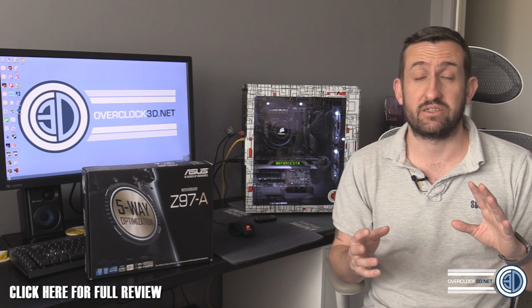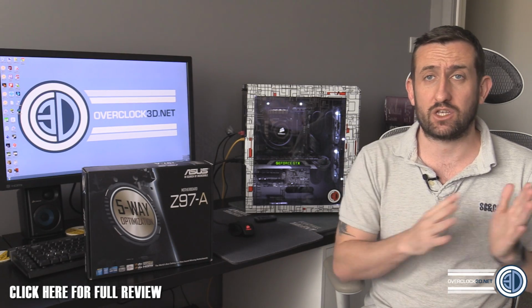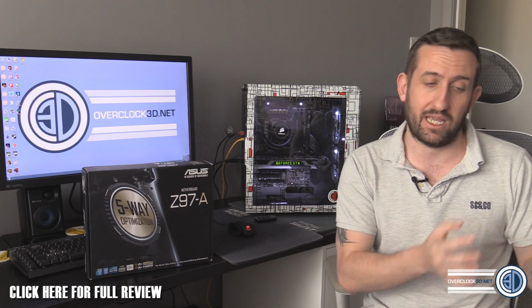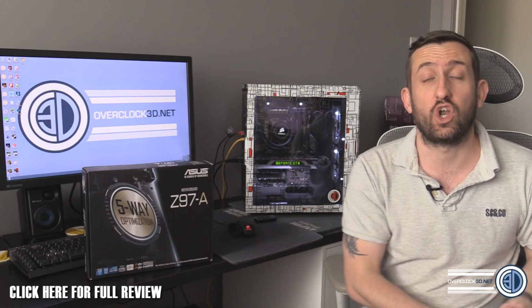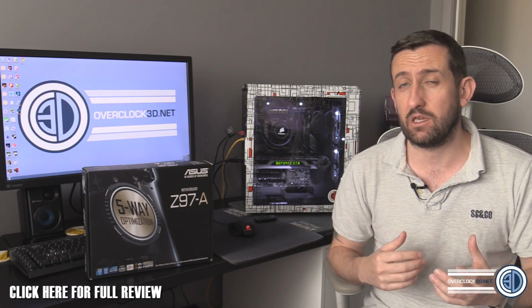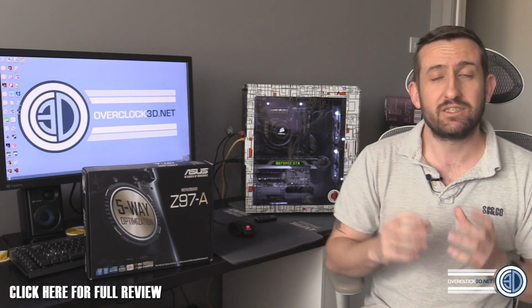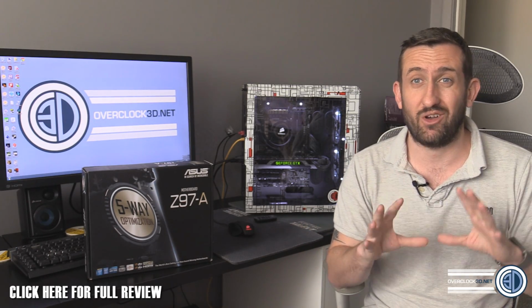Hopefully, and this is the theory behind it, we're not 100% sure, because until we start testing we don't know, it could open up the variables between different boards again. It could mean that a cheaper board will not overclock as well as some of the more expensive boards. But therein lies a bit of a conundrum, because the CPUs, like Ivy Bridge and Haswell, are so very efficient, we still don't know whether they actually need all these power phases yet. And that's really where the voltage controller comes into its own.